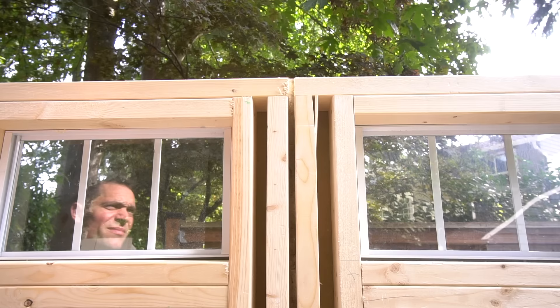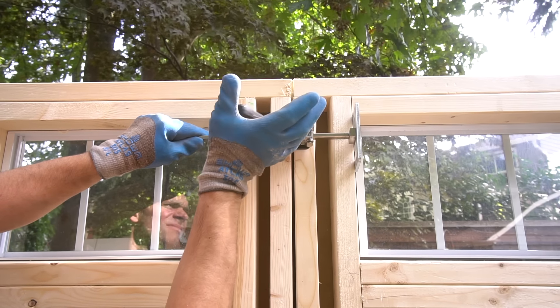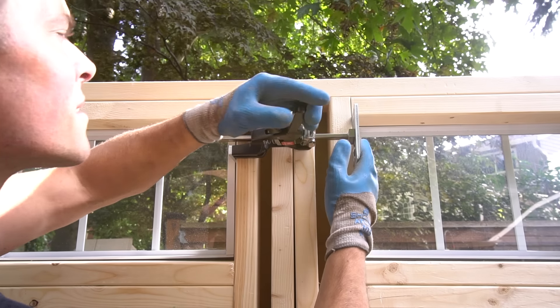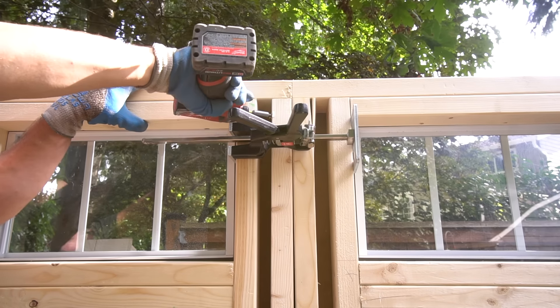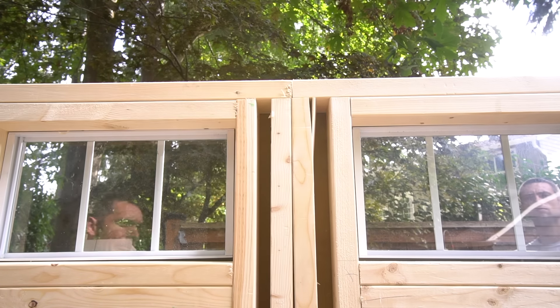Once our next panel is resting on our floor system, I remove the lip guard with ease and then slide it into place. I give the base plate a few love taps along the way and then secure it to our floor joists. As you're installing your panels, you may come across one or two that need a helping hand to get a little bit closer prior to fastening, which is why a helpful clamp is all you need to properly secure it — then take the clamp off and we're good.